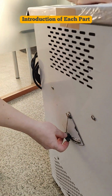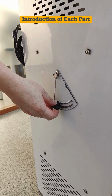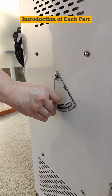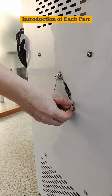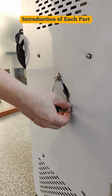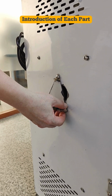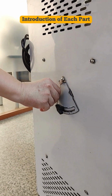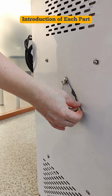This is another suction adjusting device. The first, loose the nut, slide the ball from the closed position and make opening step by step to reduce negative pressure. And as well, this device is to be used depending on the variety of the materials.